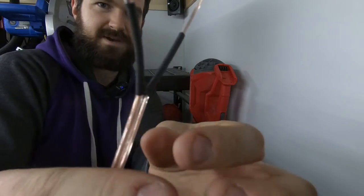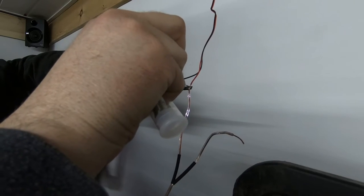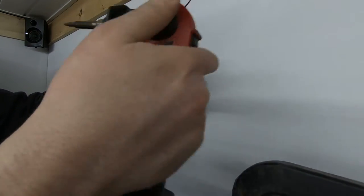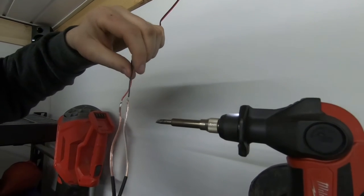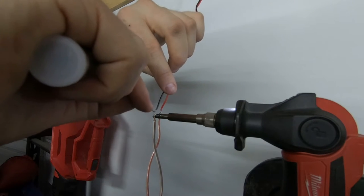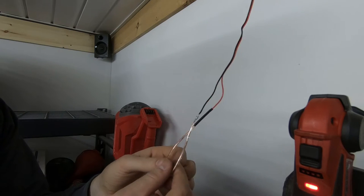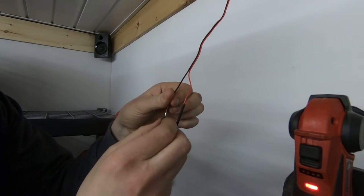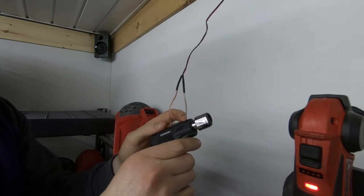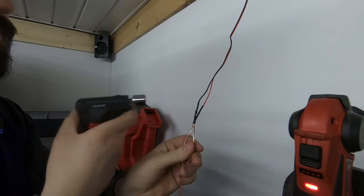When it's ready it will go solid — okay, there it is, it's ready to rock. I've got some shrink tube that I'm going to put over the wires so I can do this in a one-and-done thing. There's a red line on this one, I'm going to match that up to the red wire here and feed my solder in there. You can actually fold the iron down like that — it'll stand itself up on the battery and you can just rest your piece and feed your solder into it. Always want to be careful — you don't want to put your shrink tube up too quick because if the solder is still hot it will melt the shrink tube before you get it all the way over. Take the lighter and you don't want to get this too hot because it will melt the wire and the shrink tube itself.